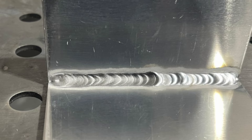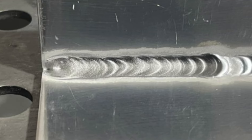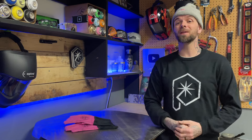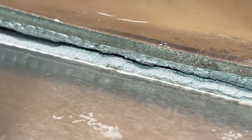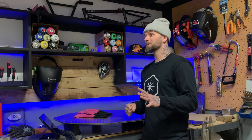Take a look at this photo — this is something that obviously has gotten a little bit hot. As we can see, it has overheated due to lack of filler material. The one thing we want to do with a joint like this is not reduce our heat, because if we reduce heat we're not going to burn in and we're not going to achieve adequate penetration. Another option when using a smaller diameter TIG rod is to push more filler material in each step.